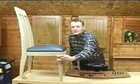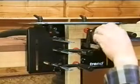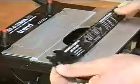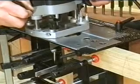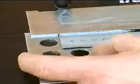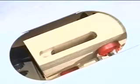The front leg mortise will need to be machined for the haunch. Insert the leg, supported by a piece of scrap wood, ensuring the edges are flush to each other. Set the sliding templates to the full width, marking the position on the top with a marker pen. The depth of cut is 11mm for clearance and rout the mortise. Then slide the template in 10mm from your mark and rout to the full mortise depth, plus a millimeter or two for clearance. The completed mortise with a haunch.